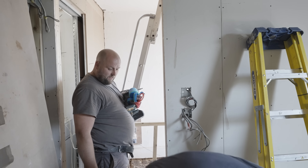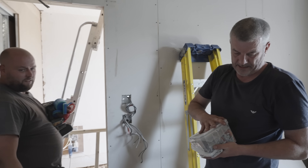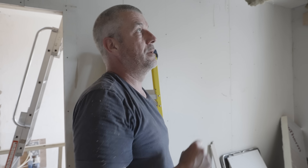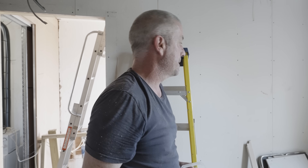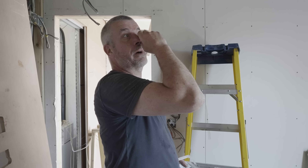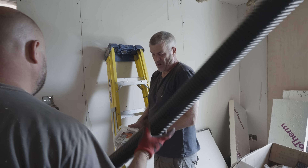We're tidying up all our mess we've made, and then it's a wrap. So today we pulled all the pipes in, bracketed them all against the wall, and fitted the rest of the plenum boxes. Upstairs in the loft, everything's pulled up there through the manifold, and once the unit comes I've got to say that's first fix done — one and a half days.